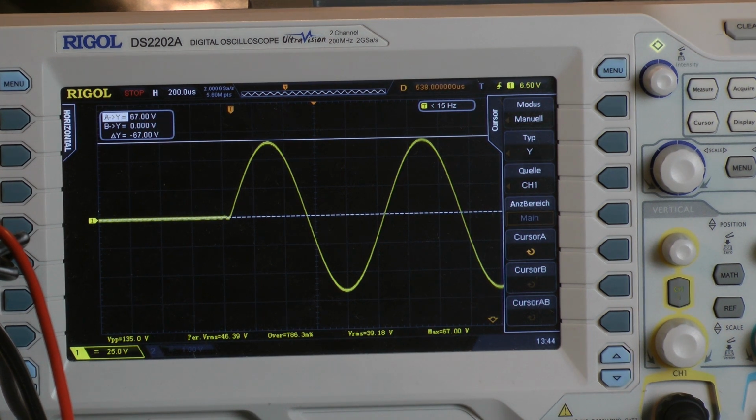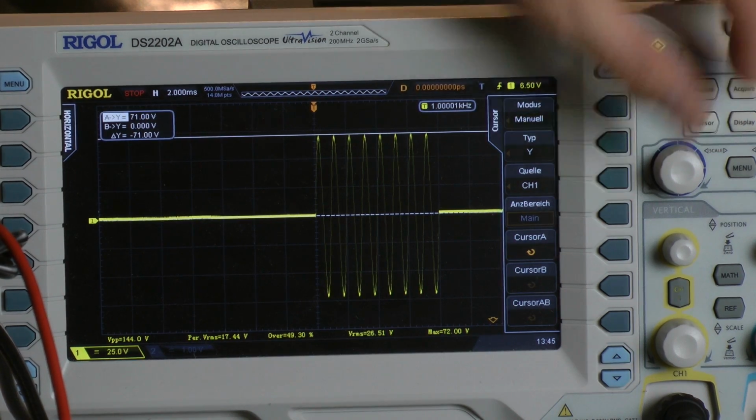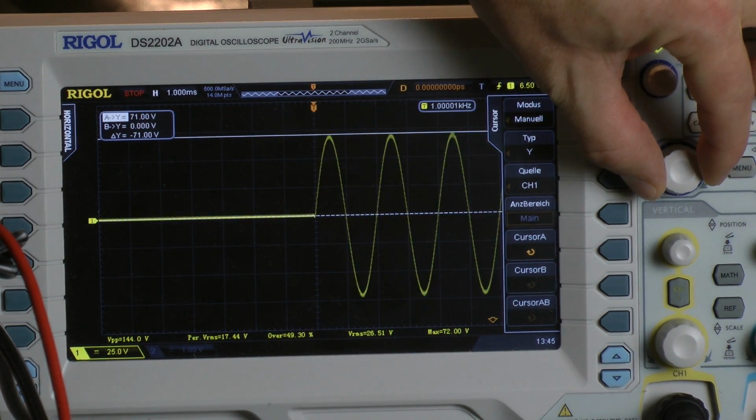Dynamically with 20 cycles the amplifier puts out mono 4 ohms 575 watts. That's 287.5 watts into a 2 ohm load per channel, both channels driven. And in this case I calculated an efficiency of 61%. 8 cycles, all cycles at the same level, you can see this here.